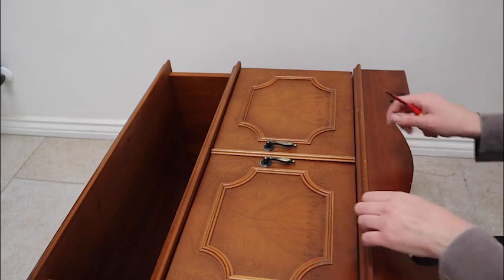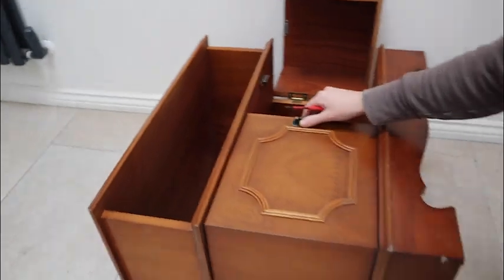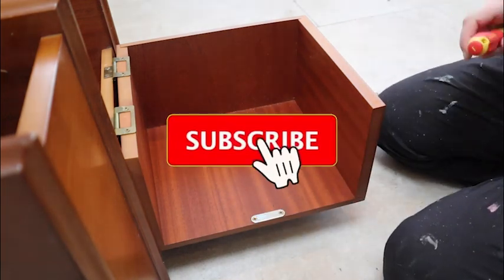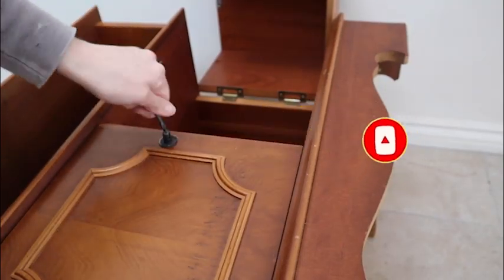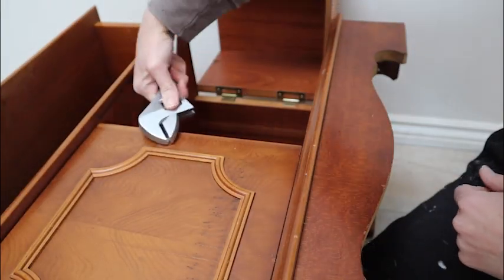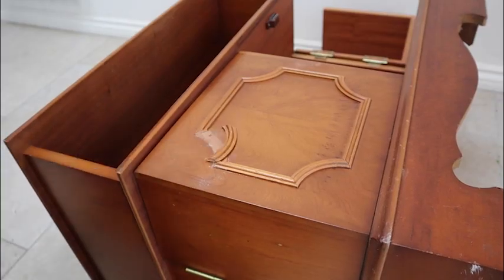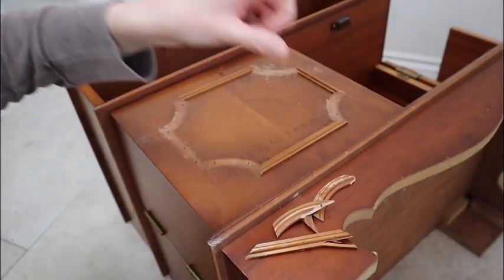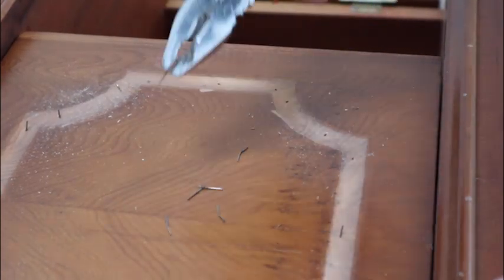This piece was free from Freecycle and is just a classic TV unit with swing-out drawers, which is probably the most interesting thing about it. I wanted most to change the handles and use cool spanner handles, so the original handles were the first to come off. I needed to make new drill holes for the new hardware, and the moldings on the front were outdated and wouldn't go with my new industrial look, so I removed those and all the tiny little nails, which unfortunately left quite a few tiny nail marks to cover up.